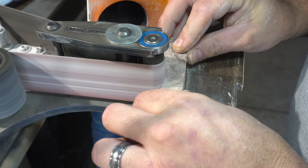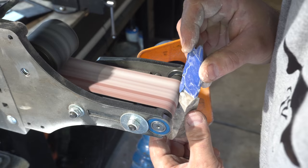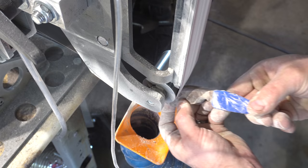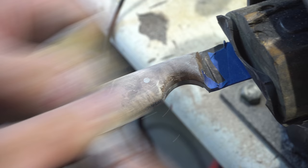I had to be careful here not to grind off my jimping. Now I'm removing some bulkiness from the scales just so it's a little more sleek — in case you wanted to put this in your belt, I didn't want it to be really thick. Now I'm going to go through that same grit progression, but I'm also going to use a piece of steel and put the sandpaper on that so I can do the tang and make sure it matches and it's all nice and flat.